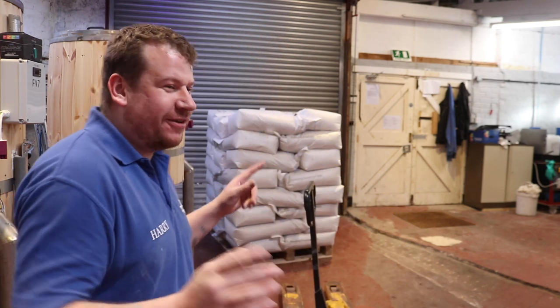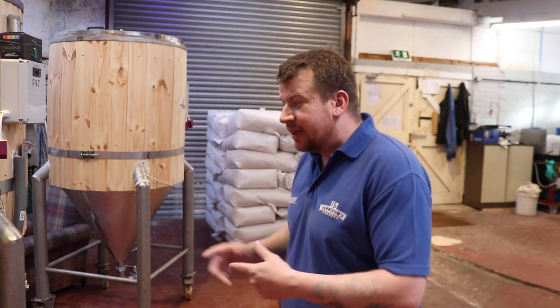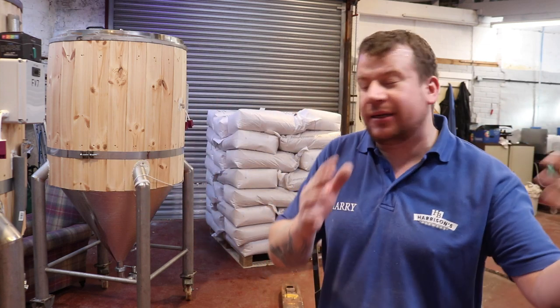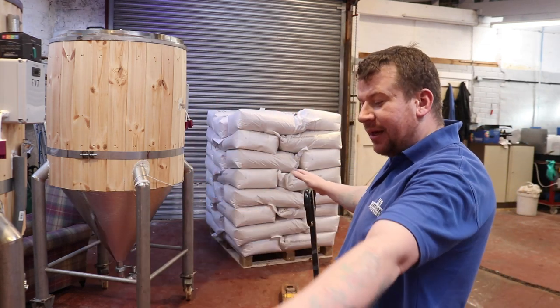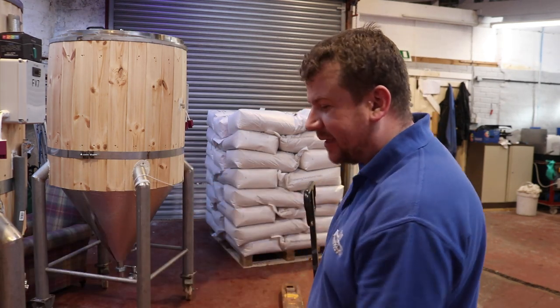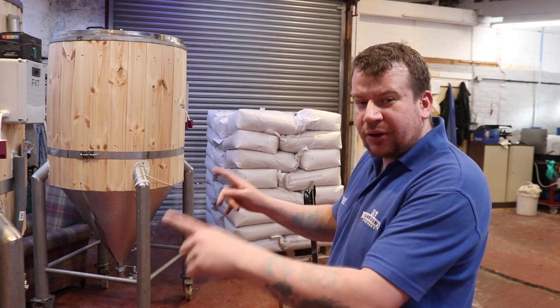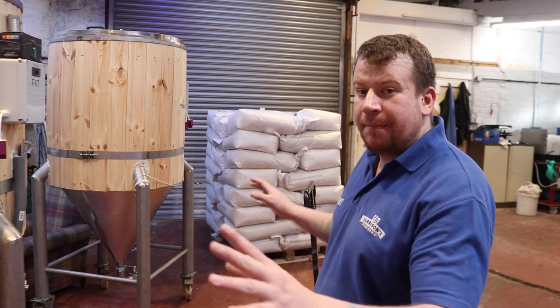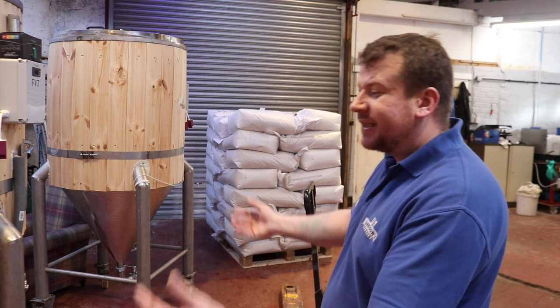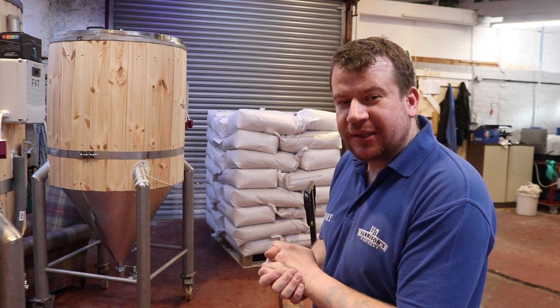Well, maybe I do. Anyway, this morning the idea is to get all of the equipment and tanks and everything emptied first of all, and then on this side of the room, where we've already painted, we're going to strip the floor back. I'm not grinding it because this isn't going to have water and brewing processes on it. It just needs repainting so it matches this side. We're going to get some self-leveling compound out, fill in all the cracks, and paint maybe tomorrow once the compound's dried, but at least it'll give us time to get the whole area cleaned, swept and prepped, ready for that paint to go down. Oh, what a start to the day.